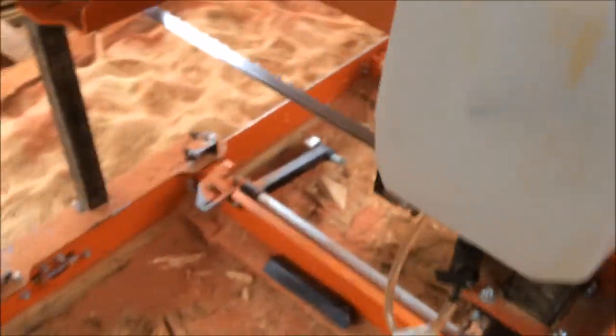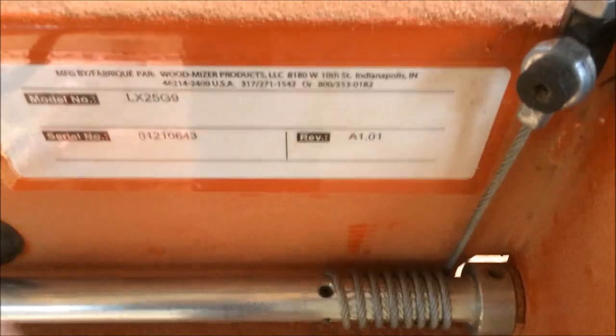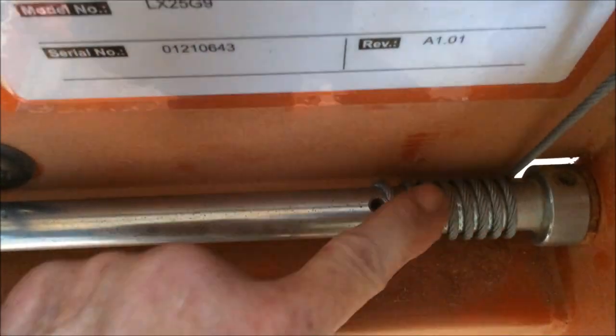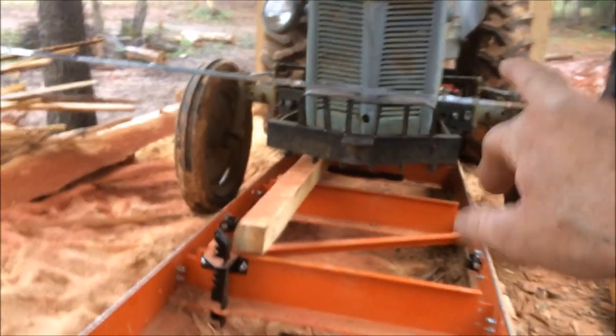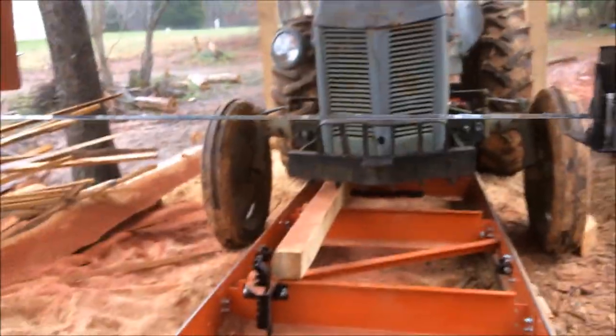That's something you want to look at. If you're having height adjustment problems when you set up your cables — you've got lift cables on the thing — here's your adjustment. Run this one up or down to get your proper height. The problem I had is to watch how your cables wrap around on both sides. You want them wrapping the same direction on both sides and going out so your cables are doing the same thing. If you don't get that, one side of your blade will be half an inch higher than the other side.